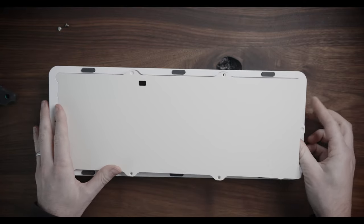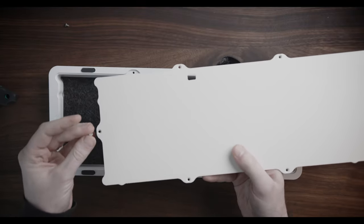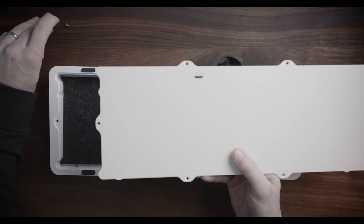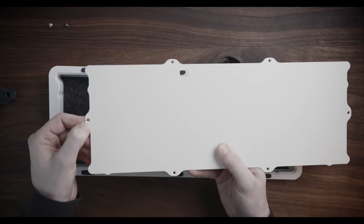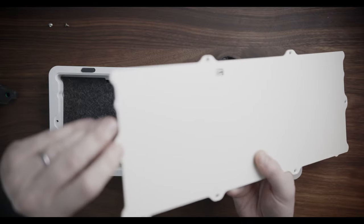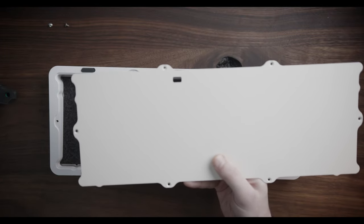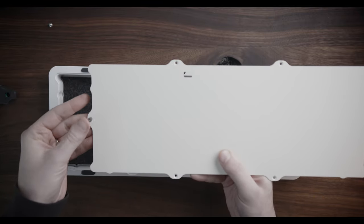Also, you may notice that under an area which is normally hidden by the screw when the product is assembled, you'll see a little area on the part that doesn't have full powder coating coverage. That's unfortunately just a necessary byproduct of the powder coating process. It has to be hung from a wire so that the part can be electrically charged to attract the powder. And so we put it here in this location because it's normally hidden when the screw is on top.